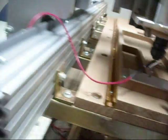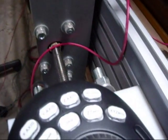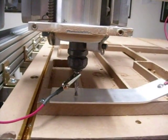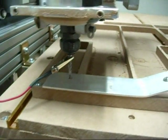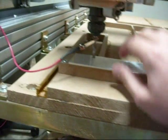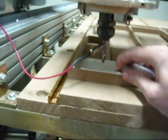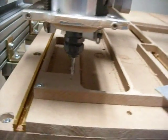I've got a Shuttle Pro and I actually just set up a macro so I can do the Z0 with one touch of the button. Just make sure you get pretty close to where you want to be, because this will only travel 2 inches, which is what it's originally set up to in the script. If you go any farther than that, it'll just run out. So just get pretty close, then touch it down. It completes the circuit, sets it up, automatically subtracts whatever thickness you set up in Mach 3, and then you're ready to go.